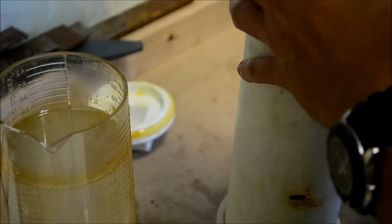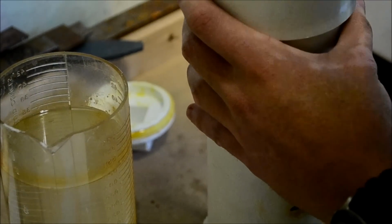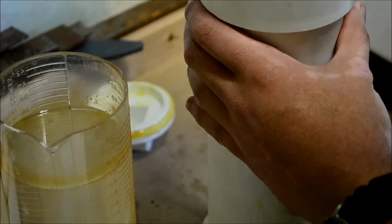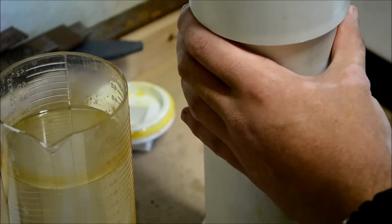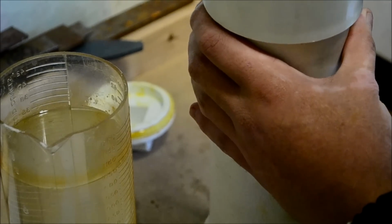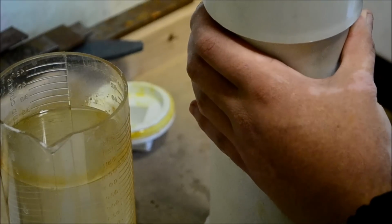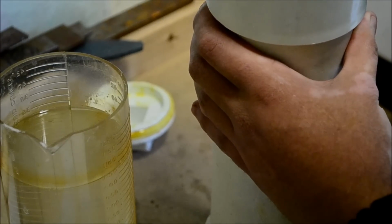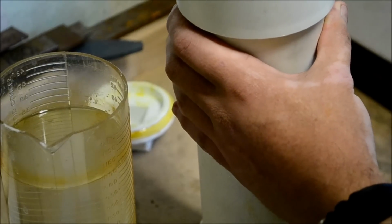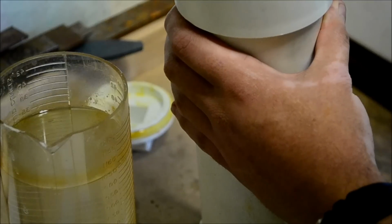And what's going to happen is when you dip that knife in the acid, it'll etch, but there'll also be an oxide layer that is created. So by stirring it around, you kind of knock some of it off. But the best way to do it is just to wipe it off, at least for the first etch, a couple edges. So that's really all you're going to get if you just stick it in there.